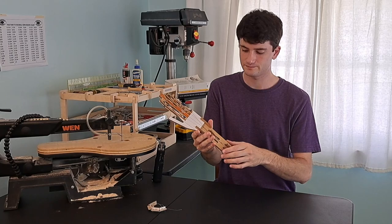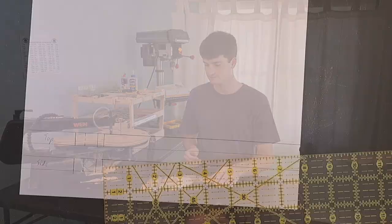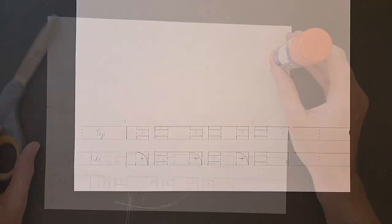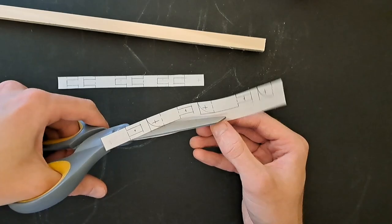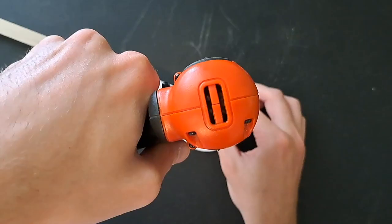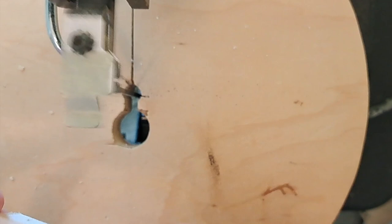The dimensions are based on my own. And again, it's not that bad. But the cardboard just wasn't sturdy enough, so I transitioned to wood. The fingers start with these templates, which I then glued to this square rod. Then I cut along the lines from each side using a scroll saw. This forms the hinges of the finger joints.